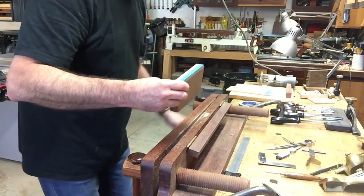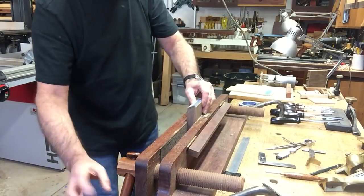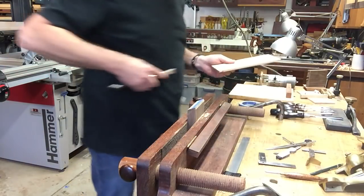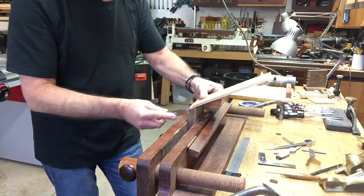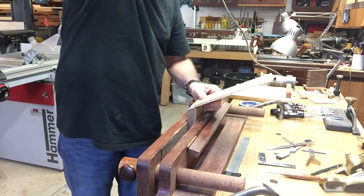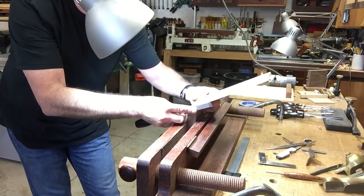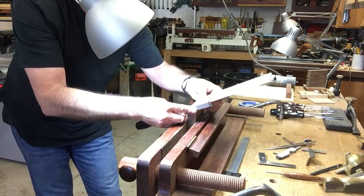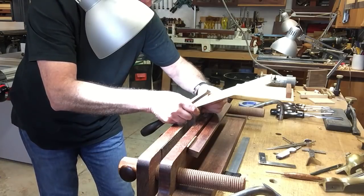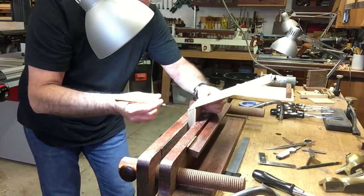Okay. Now we can get back to our pin board. That in. That should register exactly on the line. Now I'm going to move this across, so I do need to see. This is rather delicate, and chisel is just to make sure it's all square, and I can actually see that that's all resting comfortably, exactly on the line as we want. Grab a knife.